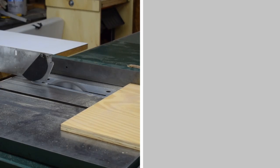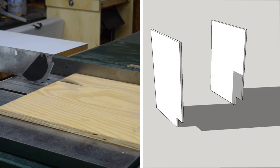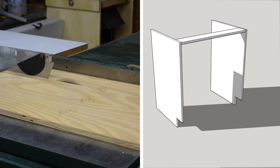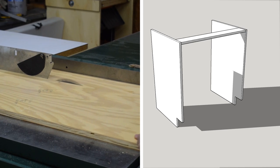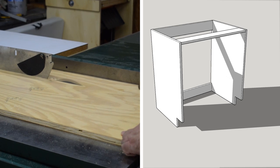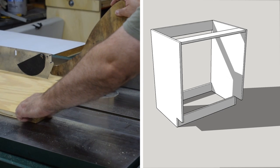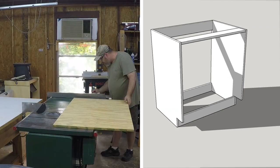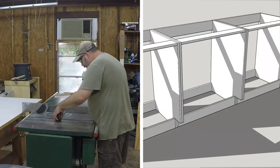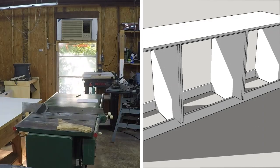Here's my basic cabinet design. I've got two sides with the toe kicks cut out of both sides, and four stretchers. One goes on the top of the front — it goes flat and will screw into the countertop once it's put on. There are two in the back that go vertically and will be attached to the wall once leveled. Then there's one more in the front at the bottom where the toe kick is, and those four stretchers connected to the sides will hold the whole thing stable and square. I'm just going to use pocket holes because once they're all attached to each other, to the wall, and to the countertop, I think it'll be just fine.